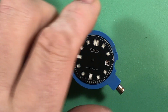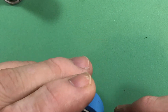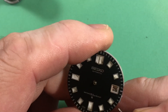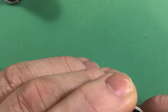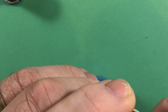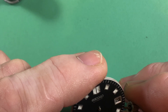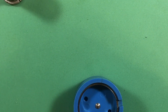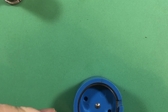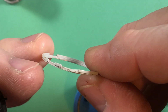Hands are off. Your dial markings are good, and again the tops of the ring — it's shattering on that, that happens. The cannon pinion feels okay. I should be able to clean up that dial pretty well. Let's get that dial off. Your dial ring is doing that shattering thing — yep, broken and it's missing a part of the edges.